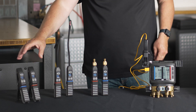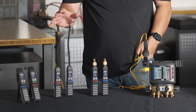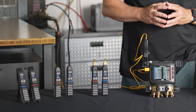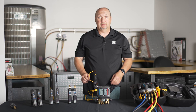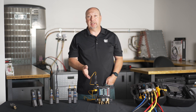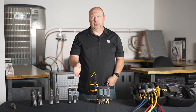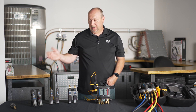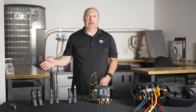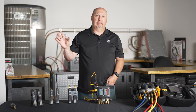One great thing about our digital wireless manifolds is they connect with our other wireless products. The wireless temperature clamps and wireless psychrometers are automatically reporting to the digital manifold. So I'm not tethered by a six-foot temperature clamp like I was in the past. You can still use K-type thermocouples if you're close, but more and more people are going to the wireless clamps and psychrometers for that flexibility.